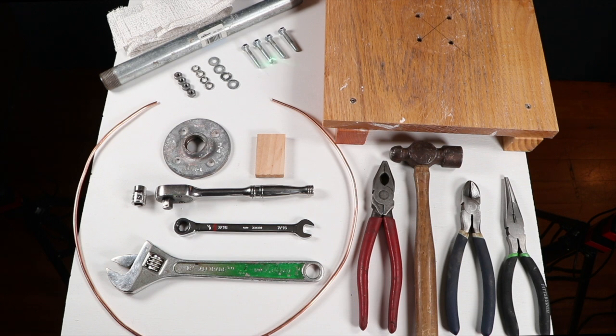Next, you're going to need your bolts. So you're going to need a 4 count, so four 1/4 inch by 1.5 inch zinc-plated coarse thread hex bolts. And that's going to be important, okay? You want that coarse thread because you want it to grab nicely. You don't want to use a fine thread. Again, all this is at any type of supply store. Next, you're going to have your 4 count here, 1/4 inch zinc-plated standard flat washers. Okay, that's going to go on top of here. And we'll get to all that when we start assembling.